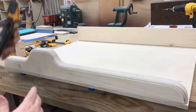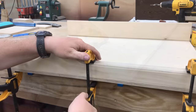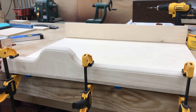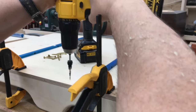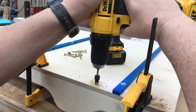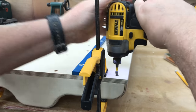When mounting the back fence, we just need to keep it flush with the back edge of the sled to look good. It doesn't matter exactly where it is because we don't use it for alignment purposes at all. I'll follow the same procedure — clamp it down, flip it upside down, and pre-drill the screws. For this one, however, I'm going to go ahead and attach screws all the way across because I don't have to make any adjustments later.